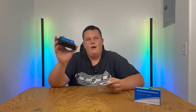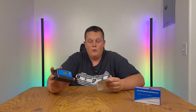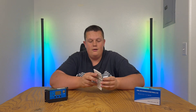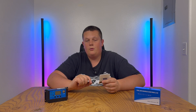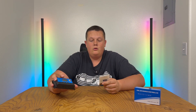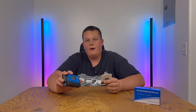When you've got your solar charge controller, connect the battery first, then hook up your solar panels and your load at the bottom. Once that's all set up, go into the work mode screen by tapping the menu button until you reach that fifth screen. The first option: if you leave the value set to 24H — 24 hours — when you turn the load on from the main screen, it will consistently provide power to whatever you're running.